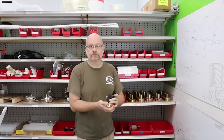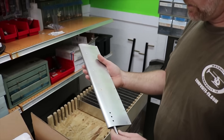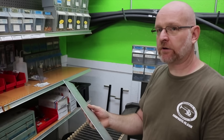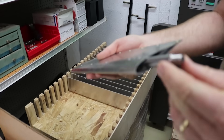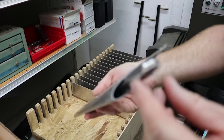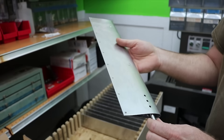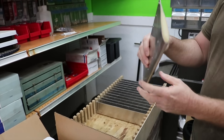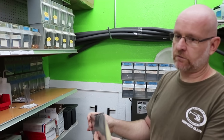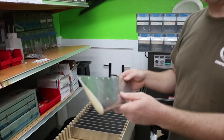What is the approximate lead time on a kit from ordering today? Six months. So we've been building our own tail rotors for the last nine months or so. Those are comprised of a 0.031 skin, an aluminum tube, a titanium rod, and various rivets. This metallic simple-design tail rotor skin is very effective — pretty low cost and we get great longevity out of it.